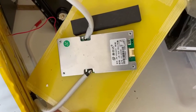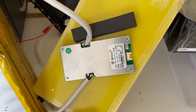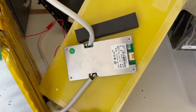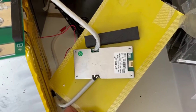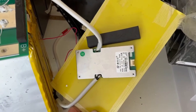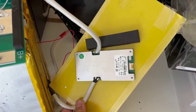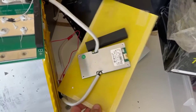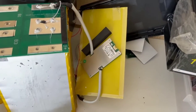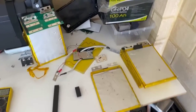I was trying to Google that emblem and the part number, and they're from National Battery Technologies in China. AliExpress is selling these pouch cells for around 25 Australian dollars each. I also Googled the BMS — it came up on AliExpress as well, available in 40 amp, 60 amp, right up to 150 amp. I couldn't find a 50 amp one, but they're about 11 US dollars, just under 20 Australian. Pretty cheap, generic BMS — which explains why the specs of the battery listed max charge and max discharge at only 50 amps.